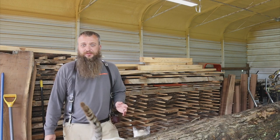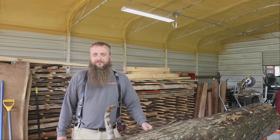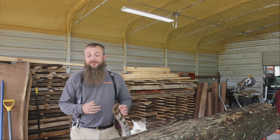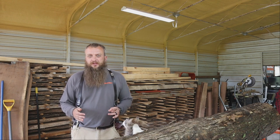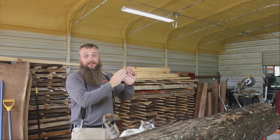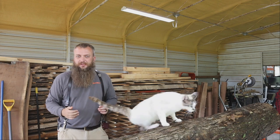His finish dimensions that he needs after drying are 4 inches by 1.5 inches. And based on quarter sawn boards, even though these aren't true quarter sawn boards, you gotta watch how stuff dries. Because when you turn this board up and the grain runs perfectly up and down, the tangential plane, which is on the sides, is gonna shrink about 1/8 of an inch.